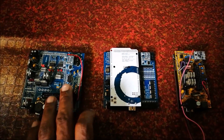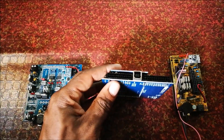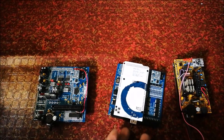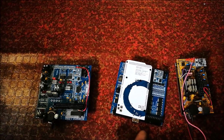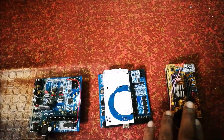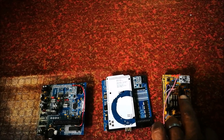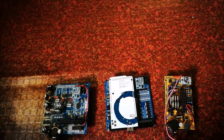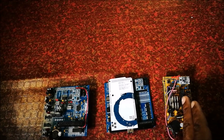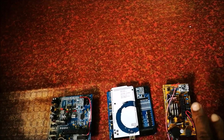The v0.4 and UA4C are functionally pretty much the same. The only difference is the breakout connectors: the v0.4 uses a ribbon cable, while the UA4C uses front-facing connectors where you crimp pins and the wires go in at the front. The NO2C has a 24-pin connector, and you can also buy panel mount connectors and solder the wire directly to the board with the connector mounted elsewhere.